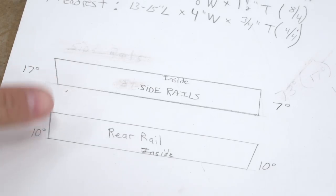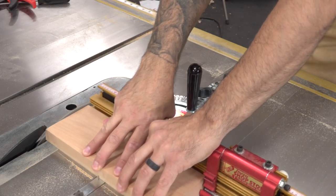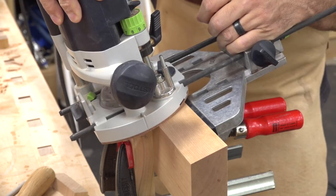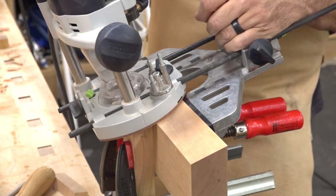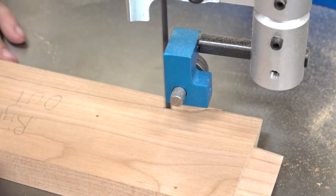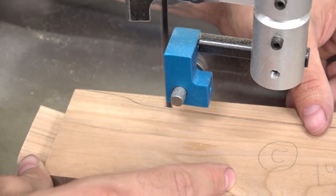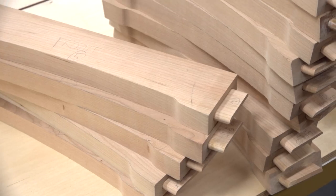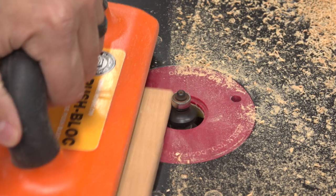The rails of the chair are cut to size and mitered to the appropriate angle on the ends. Normally this would be a nightmare to mortise, but with a simple angled support board the process is pretty easy — a variation of a trick I learned from fellow woodworker Matthew Teague. The rails receive a decorative cloud lift inspired by Daryl Peart's Green and Green Aurora furniture. Cut-off stock is used to create the loose tenons, and we can now do a quick dry assembly.